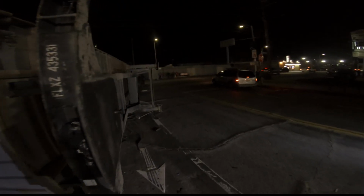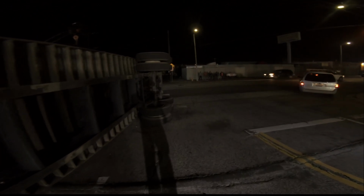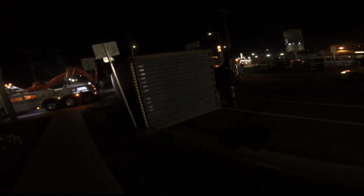So I talked to Jonas briefly about his game plan. He says the chassis is good, but he's going to split it, remove the chassis forward, then him and I and Hulk want to flip it over and let it slam. The reason is that on this customer the load is cut up metal, wire and a bunch of other stuff, very heavy, and it's always horribly shifted. So instead of counter leaning it in midair, by slamming it over he thinks it'll be better to correct itself.